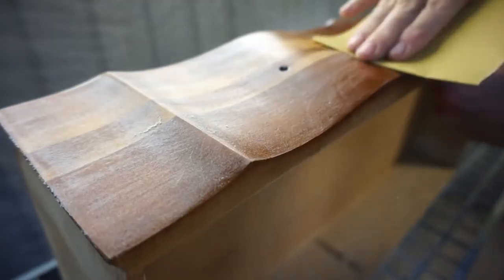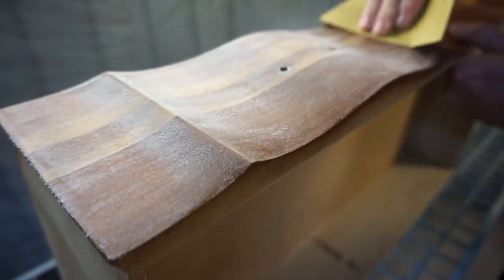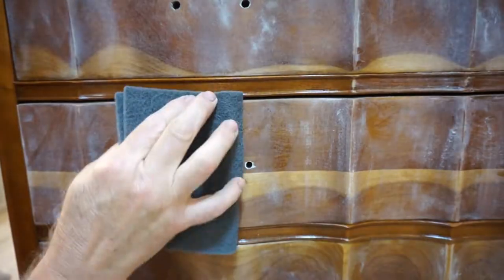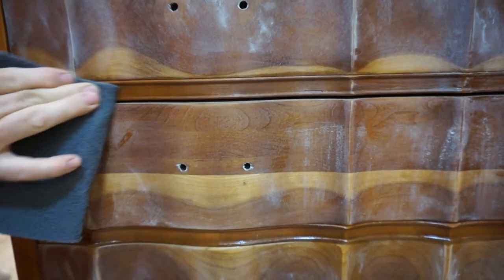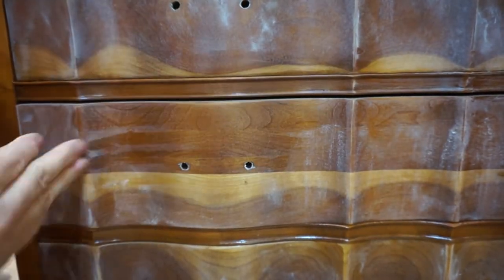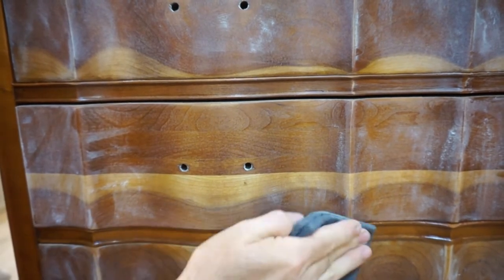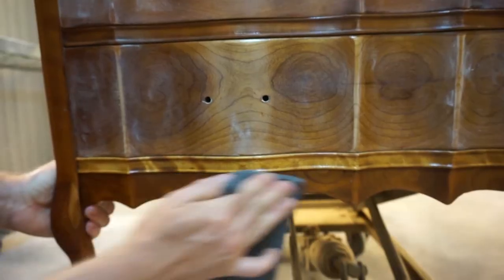Now to sand the drawer faces, again, I'm using 320, just a piece of sheet paper. I'll sand those and just clean it up a little bit, get rid of all the little burrs. And to do the framework, I'm using a gray Scotch-Brite pad. Now I'll put links down below so that you can see the products that I'm using. If you look down in the description, there'll be links for all of these different types of products.